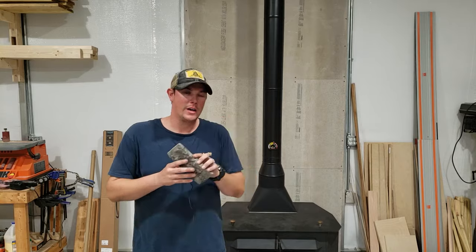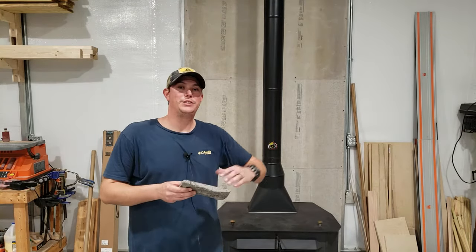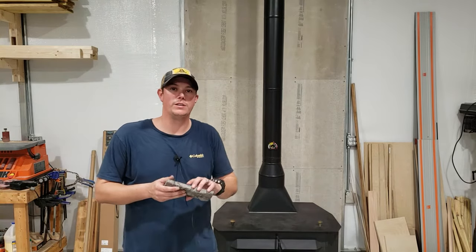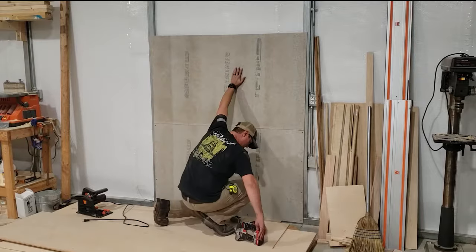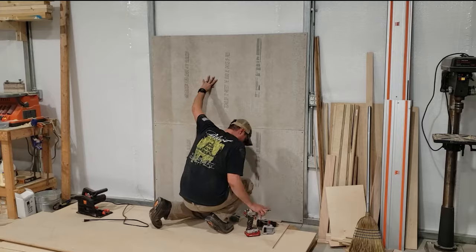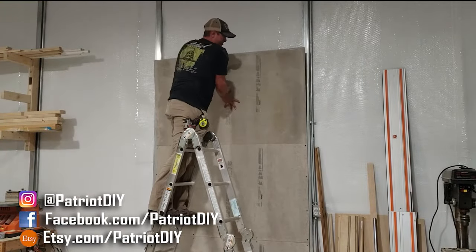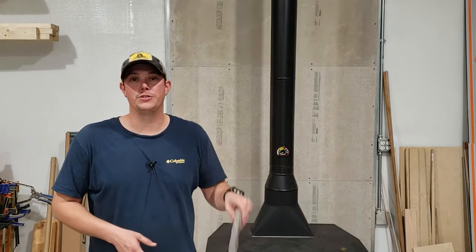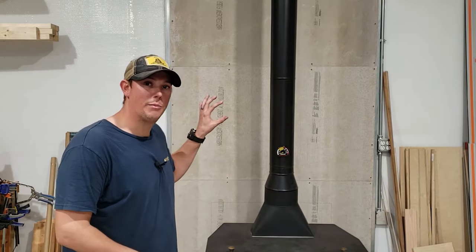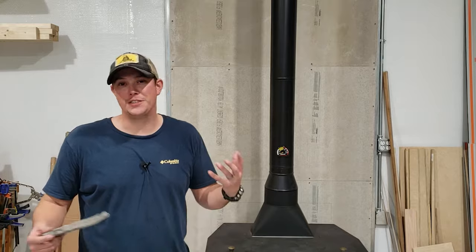These are individual stones, so you can stack them at random pretty much any way you want, and they can be installed on nearly any wall surface, including wood and sheet rock. We've already prepped our wall — since this is going behind a wood stove, we decided to put up cement board to make it as heat resistant as possible. If you're using this type of stone near any heat source, especially a wood stove, make sure you're using the fire rated product. We've used cement board backer, fire rated Evolve Stone, and we're also going to be installing a heat shield behind the stove as an extra layer of protection.